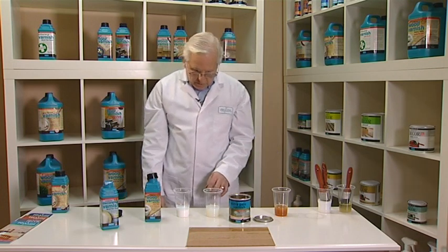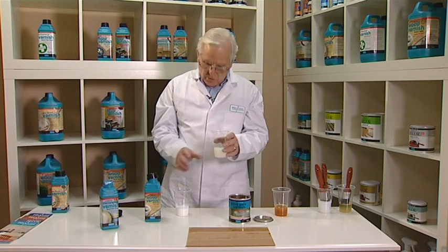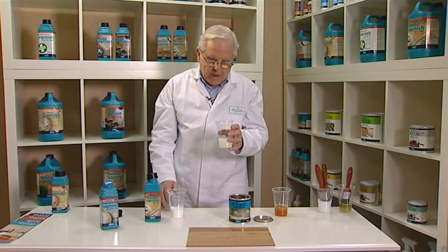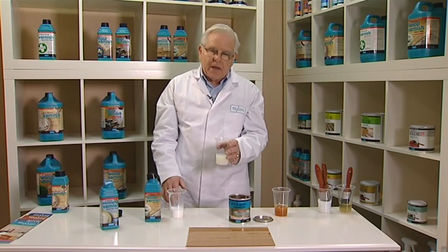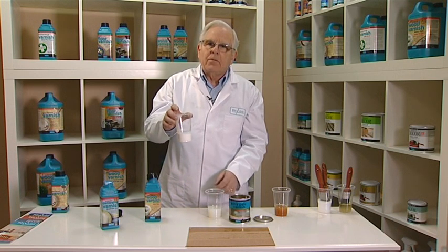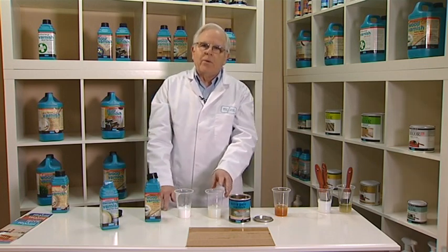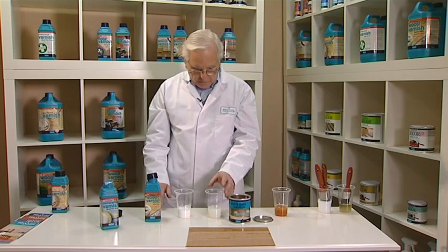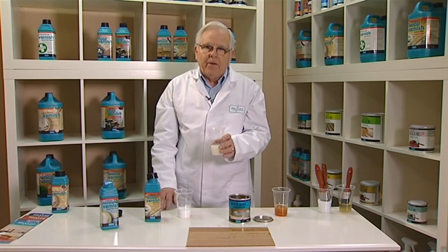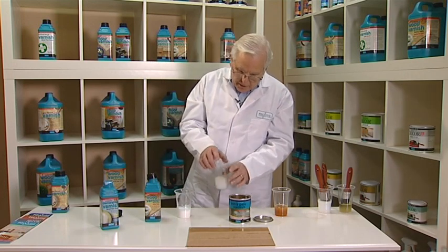All water-based products dry fast — both acrylics and water-based polyurethane heavy duties. However, the heavy duty does dry faster than the acrylic: around one to two hours for the acrylic, and under an hour for the polyurethane. Heavy duty polyurethanes will cure in 16 hours, while acrylics take up to five to seven days to cure. Curing is when the chemical process is complete and all attributes — water, chemical, and abrasion resistance — are fully achieved. Heavy duty products have much higher chemical resistance, making them excellent for areas exposed to food stains, juices, and alcohols, making them a very good bar top material.